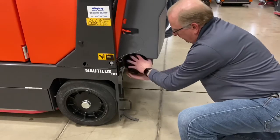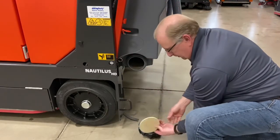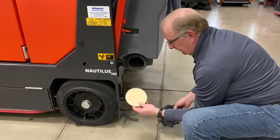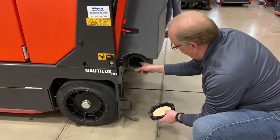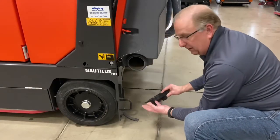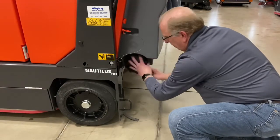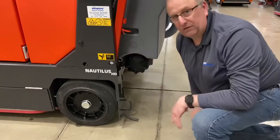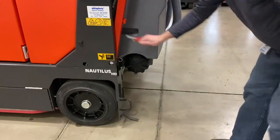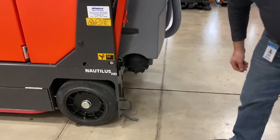Come down and loosen the cap. You have a gasket inside the cap — don't lose this. Drain it out, getting all the dirt out of there that may have built up over time. Once clean, reinstall it hand tight. Put the pin back in its safety spot.